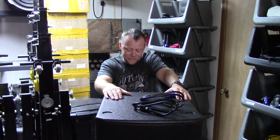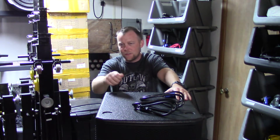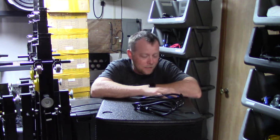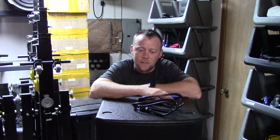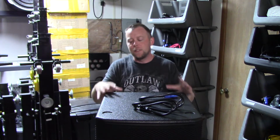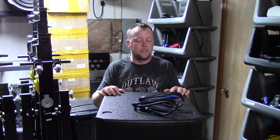I plugged it in with an IP500, and I was messing with the user selectable crossover, and this is my one big gripe. If you get anything out of this video, I'll actually probably put it in the description, because this is my main point on this subwoofer and what I'm disappointed about. I'm gonna keep this in inventory, I'm not gonna get rid of it, but I'm not super happy with my purchase. It does not have a high pass filter on the outputs.